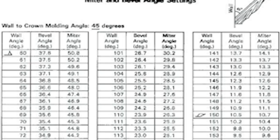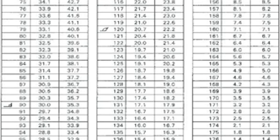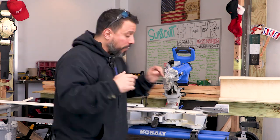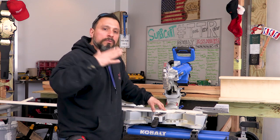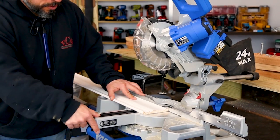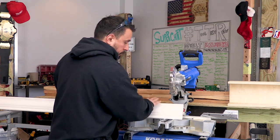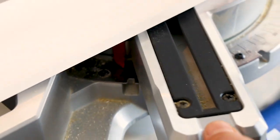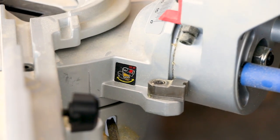All we're going to do is use the miter and bevel functions on the saw. To determine the miter and bevel settings, you can refer to online resources or buy a handbook that breaks down corner angles and tells you the miter degree and bevel degree. You can make a copy of that information, laminate it, and keep it in your toolbox. What's great about this saw in particular is that for standard angles like 90 degrees, it already has those degrees built in. Let's say we want to make an outside corner on the right hand side — we'll set our miter scale to 31.6 degrees.